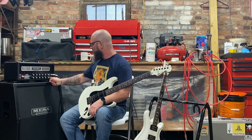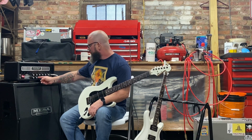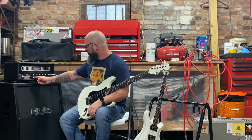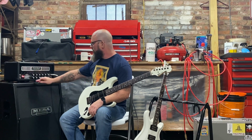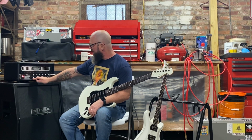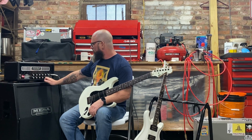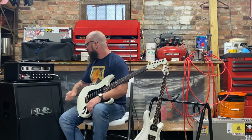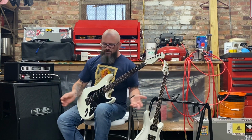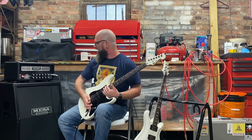So we'll finish up here with some settings that I kind of liked yesterday, and we'll move the volume up just a smidge because everyone likes more volume. Where we're at, we have our master at about 10, our presence at 10:30, our bass is at 1:30, our mids are at 1, our treble's a little below noon, and our gain is about 1:30. I'm going to play that same riff that we played several times through, and we'll wrap this one up.